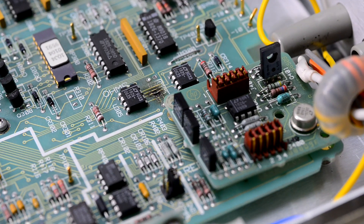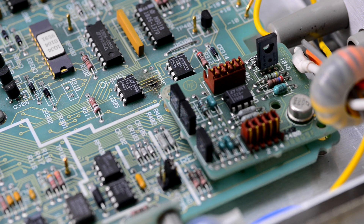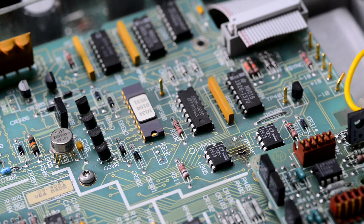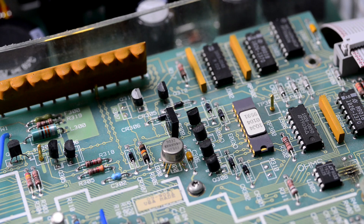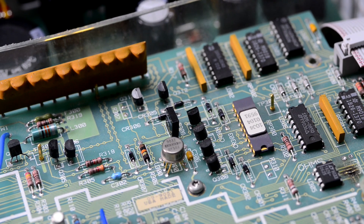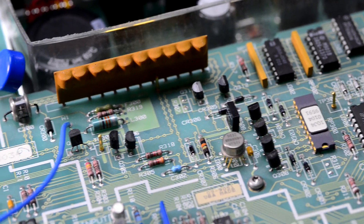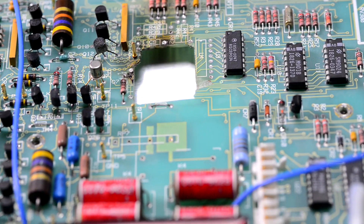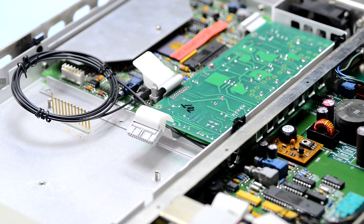There is also damage near U305 — a resistor and an MLCC capacitor caught fire, just a little one. So we will probably have to drill that piece and that hole a little bit more. Quite a lot of work needs to be done on this A1 DC board to make it somewhat functional before we can even start testing if any of the chips still on board are damaged. I suspect a high-power, high-voltage signal was applied and that blew the board up.